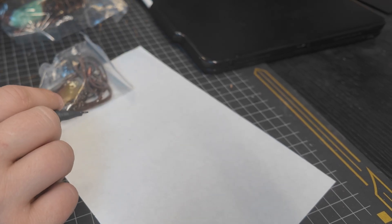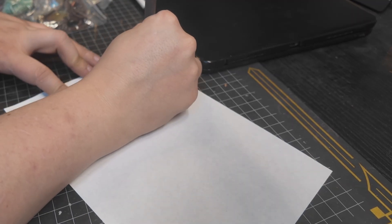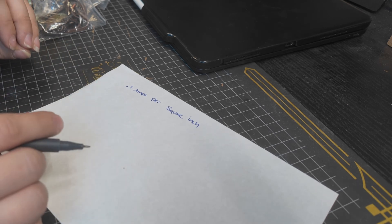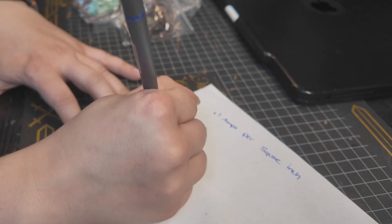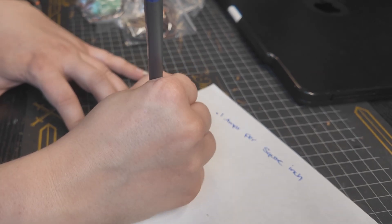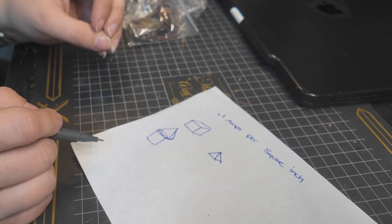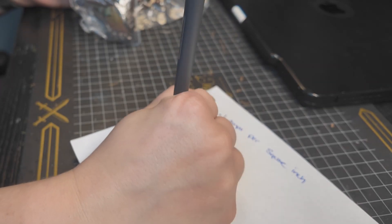When you're trying to figure out the math, take your piece — sometimes you can even redraw it on paper and separate it into shapes. You need 0.1 amps per square inch. The easiest way to do that is to take your design and break it down into geometric shapes: cubes, cylinders, maybe a cone on top of a cylinder, pyramids, spheres — basically looking at geometric shapes and breaking your design down into them.